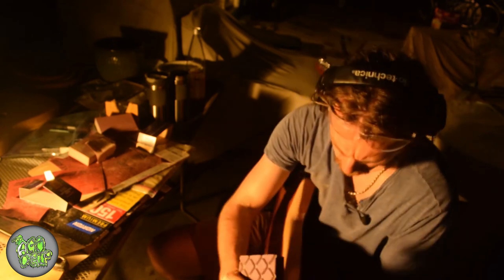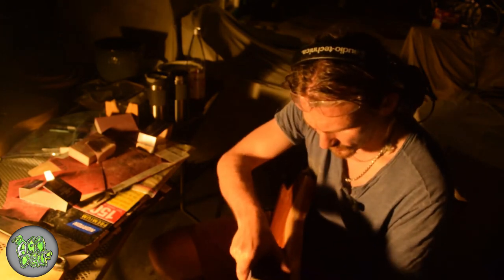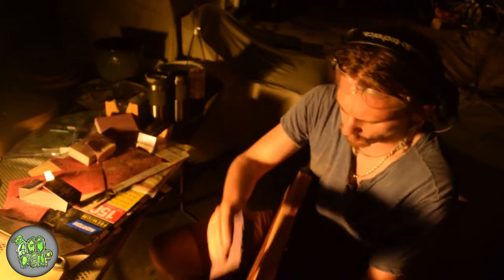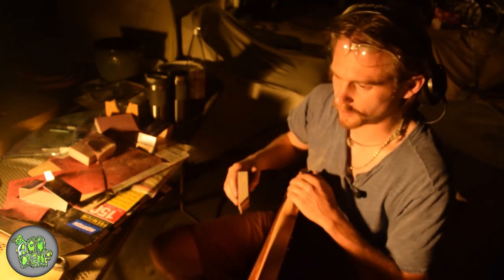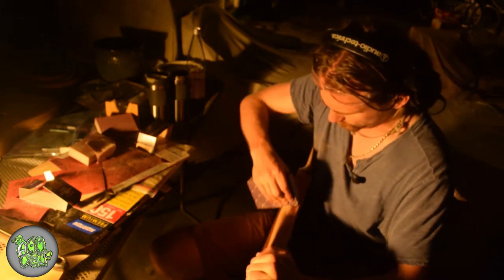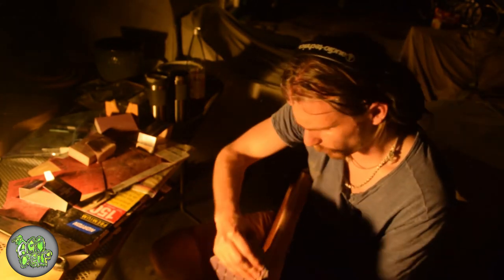But when you seal the wood, which we will eventually be doing with linseed oil, as I discussed earlier, you separate the wood fibers from the open environment. That's basically what sealing does to it. And so what's being exposed to the wet sandpaper is actually not the wood itself, but the linseed oil. When you saturate this with linseed oil, you're creating such a thick buildup that it completely soaks and saturates the wood, so that the wood isn't really coming into contact with the wet sandpaper. It's just the linseed oil. And that's kind of the purpose of the wet sanding, is to polish the linseed oil.